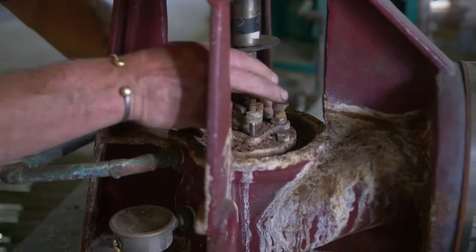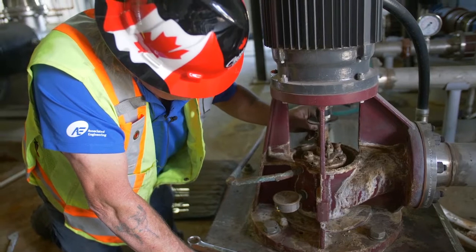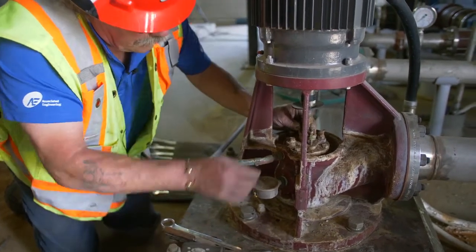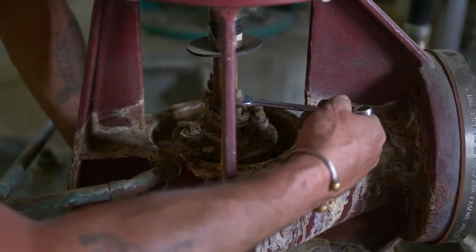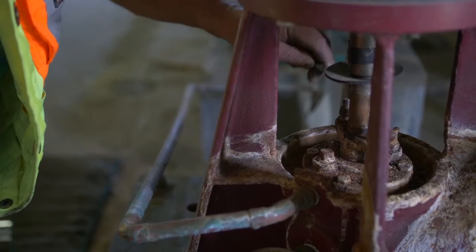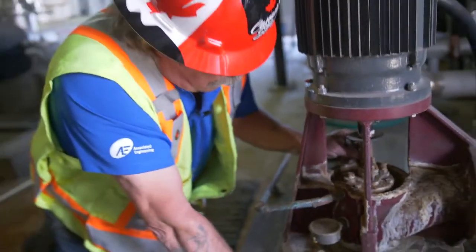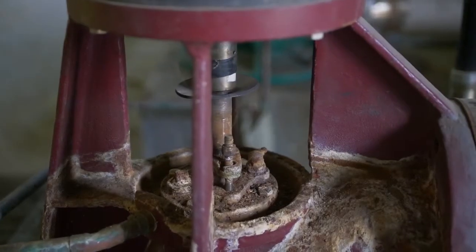Once you get it down kind of tight with these bolts — close, just rubbing quite tight with just a little bit of friction on the wrench — then you'll start to pump and it'll spray water out all over the place. As it's spewing water, come in with your wrench and tighten it up. Don't touch the shaft because it's spinning. Half turn at a time until you have no water coming out, and then you can seat your oakum.